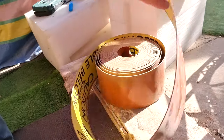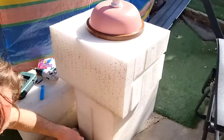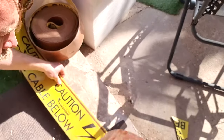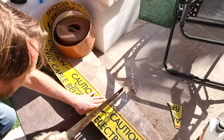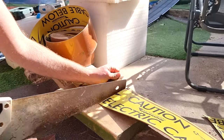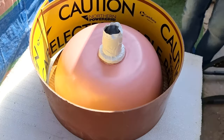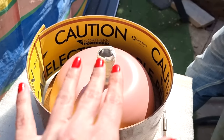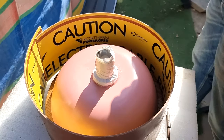But we need it to be about 100 centimetres. We've just measured up the size of the mould. Yeah, we need about 100 centimetres. So we're going to cut that and then use the silicone seal to attach it to the mould. So we've got the Perspex substitute, if you like. We're going to put a load of screws around the edge to secure it because we don't want the concrete to push out and the mould not be as smooth and structured as possible.